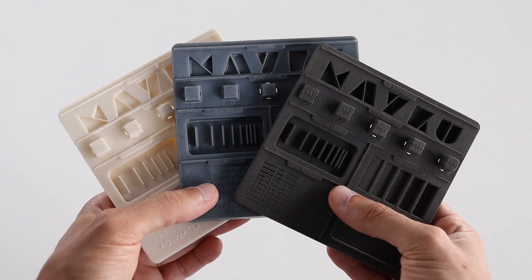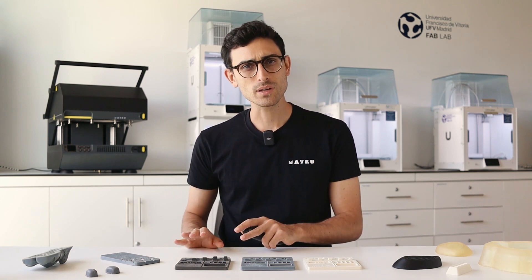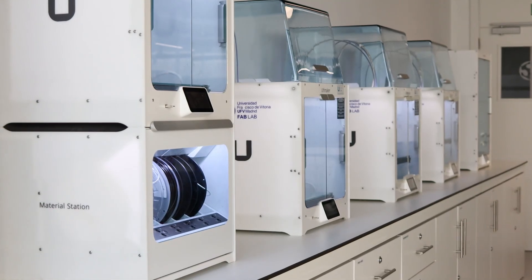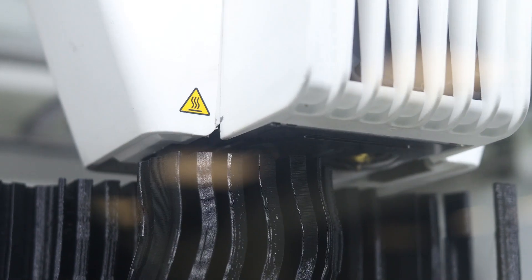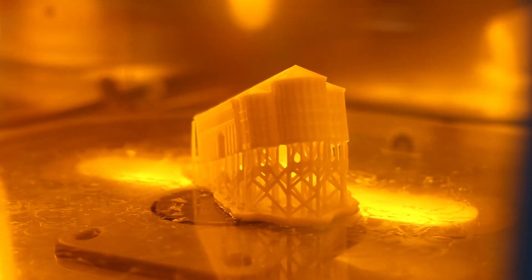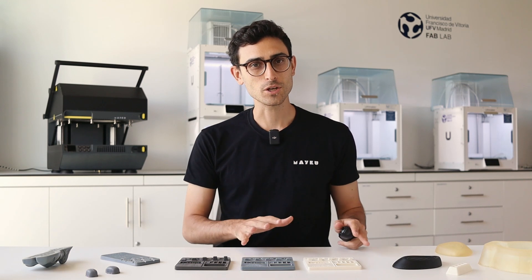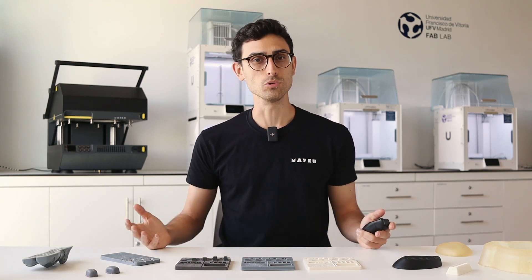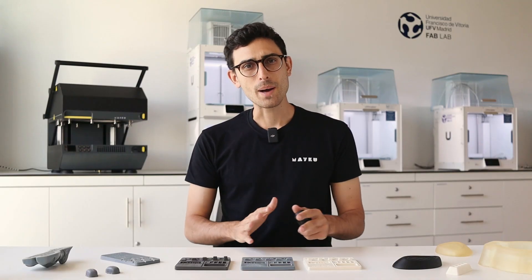But now it's time to compare these three technologies, so let's get started. First, let's do a very short recap on how each one of these technologies works and what we are making with them. FDM 3D printing uses a continuous filament of plastic material to make 3D objects, melting and extruding the material layer by layer, building the objects from the bottom up. SLA 3D printing is a type of resin 3D printing in which a light source — a laser or projection — polymerizes a photosensitive resin. And SLS 3D printing uses a high-powered laser to fuse small particles of plastic powder together. With these technologies and many others, we are making thermoforming templates or tools, which are the objects you insert into a thermoforming machine to give a plastic sheet a specific shape.